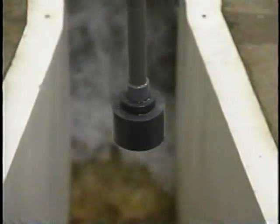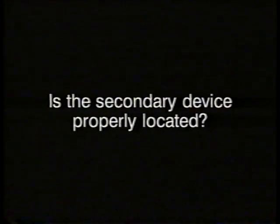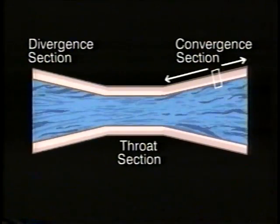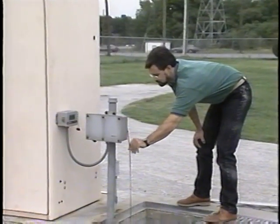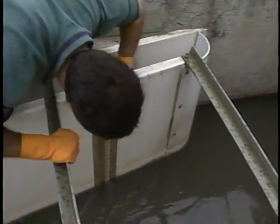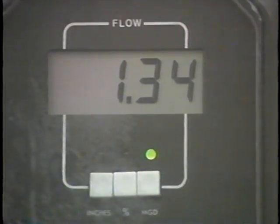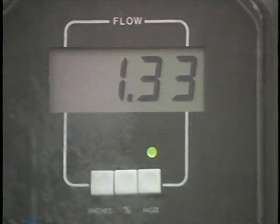But there are four questions you should ask as you inspect these secondary devices. Is the secondary device properly located? The secondary device should be two-thirds the distance of the convergent section wall upstream from the throat. Has the device had adequate maintenance? Make sure there's a schedule for calibration and maintenance as recommended by the manufacturer. Is the zero setting correct? Check to see that the head measurement device is zeroed to the appropriate setting. Did you read the output correctly? Human error is a common cause of inaccurate measurements — make sure you understand the calibrations and interpret them correctly.